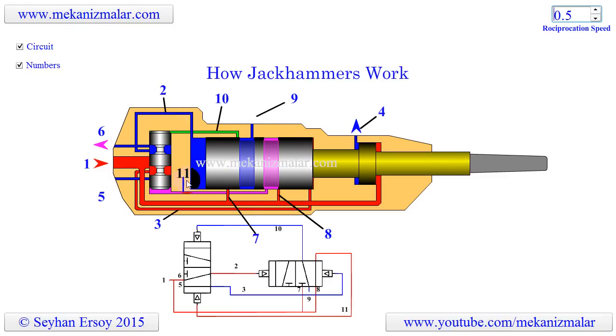When the operation reverses, the bottom of the piston is pressurized through pipe 3, and air at the top of the piston is sent to atmosphere by pipe 2. During this process, air bleeds out from the shock absorber chamber at point 4. The purple arrows at points 5 and 6 show the discharge of pressurized exhaust air alternately. The spool changes its position via the piston — the piston chamber and piston actually act like a large spool valve.